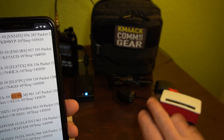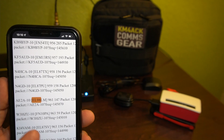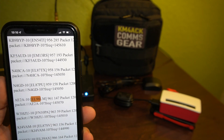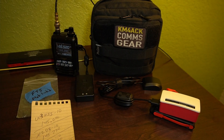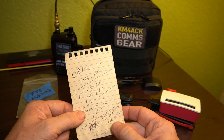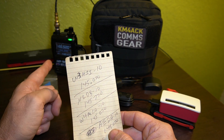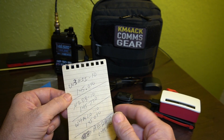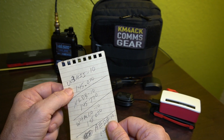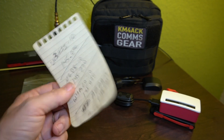The first thing I did is I have a GPS hooked up to the Raspberry Pi so I can get my current grid square. Knowing the current grid square — it's Echo Lima 98 — I went ahead and used a packet list stored on the Raspberry Pi and did a search for Echo Lima 98. With those search results, I came up with four different stations that we may possibly hit from our current location. We'll have to key each frequency in manually because this does not include rig control, but we'll try to make a two meter packet connection to each of these stations, going through the list until we make a connection or fail.